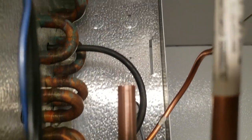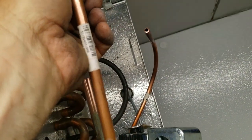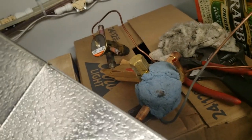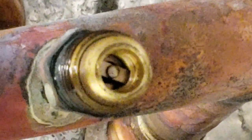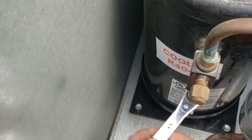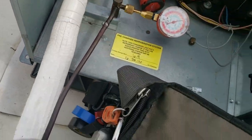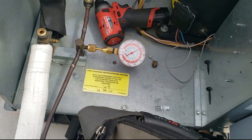Got our valve ready to go - went ahead and cleaned it up, got some of the last leftovers out of there. Got the strainer here; it's going to go up into the valve body and be held in place, then just get her brazed in. Everything's prepped and ready to roll. Going to yank the schrader core out - look at that, it's all collapsed in there. Hopefully we can get it out; if not, we'll put a brass cap on it. Got a slightly bigger dryer in there too - an 083.